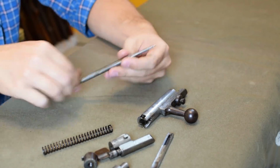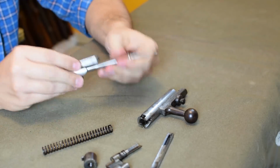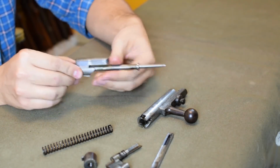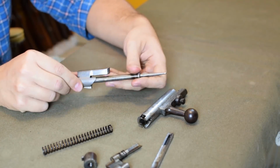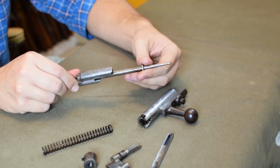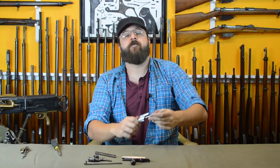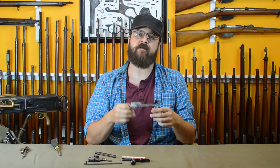On this guy, and let me get that safety out of the way, we actually have no ability to go past that mark, and that mark is ahead of it actually coming down the firing pin. So that means that that mass gets added to our strike. That really helps with our clear firing, no more light strike issue. All right, I'm waving a bunch of parts around. Sometimes it's hard to see how they interact, so let's go ahead and get over to the animation.